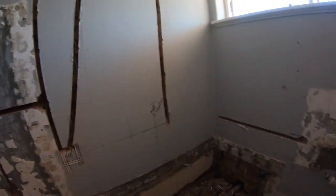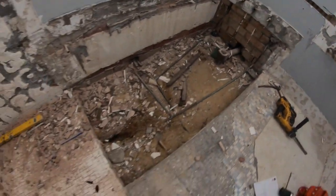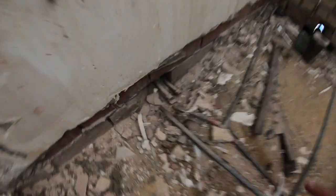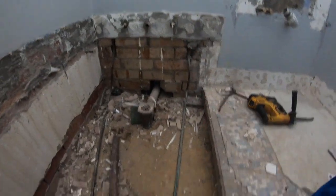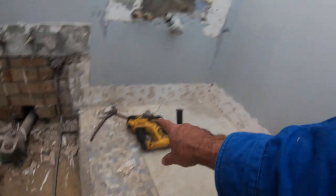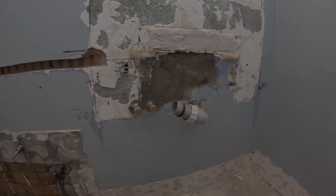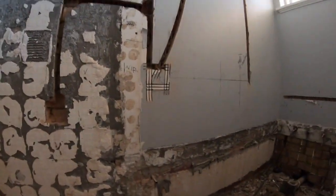Because you drop all this money on a new bathroom and then you've got to knock up your floor later on. And I was right — occasionally I'm right. You can see here, all the water pipes go under the slab. These two pipes are coming out from the laundry side, then it goes off to the bath, and another line goes off to the cold side of the bath. Then they go under and up to the bathroom basin, and another tee goes down and over to the shower.